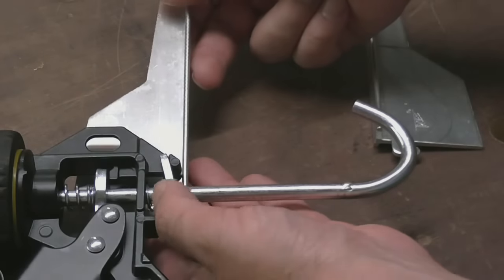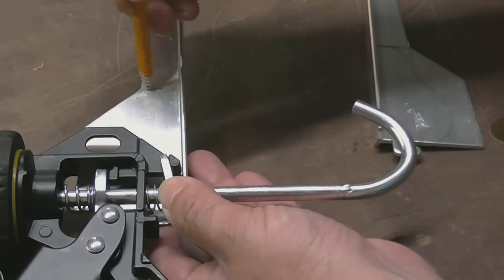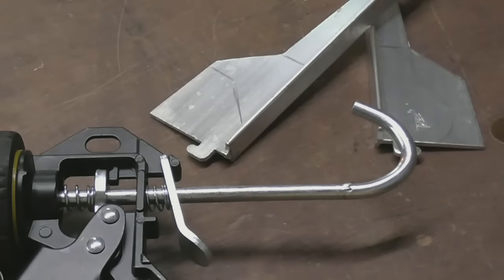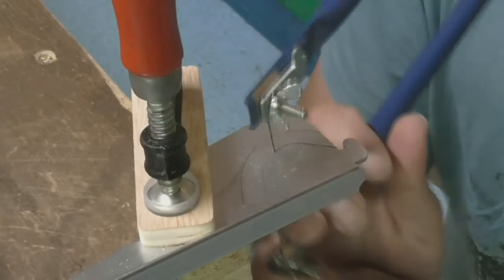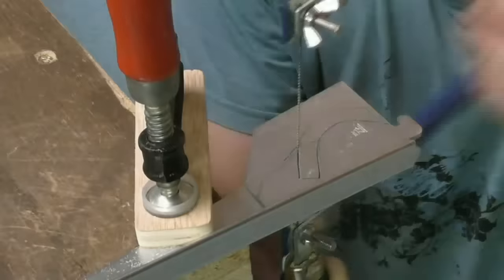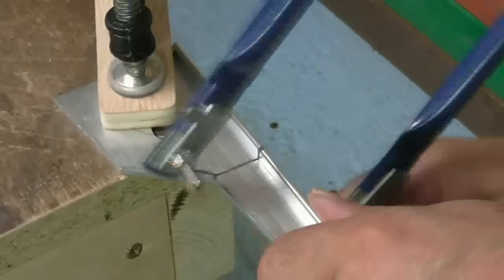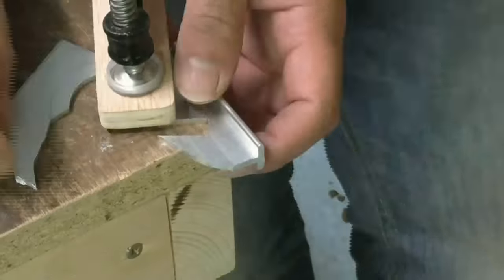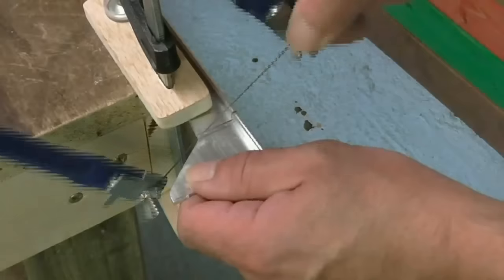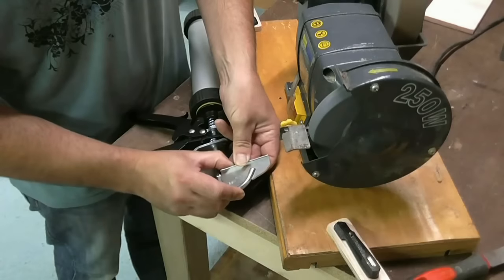To make the fixed jaw, I use another aluminium piece, and I draw the shape I need on the aluminium. I will cut it at the same height, and I have to cut the bottom of both pieces, and in this case I have to make there a vertical cut. This aluminium piece can be cut with a marquetry saw. But I also have to make some work with the grinder and with a file, to make them fit better.